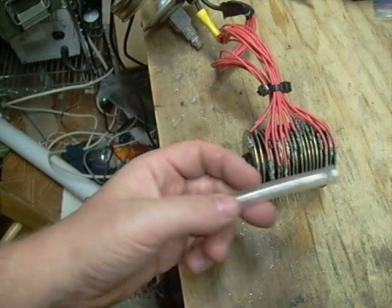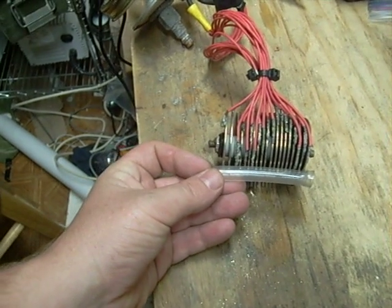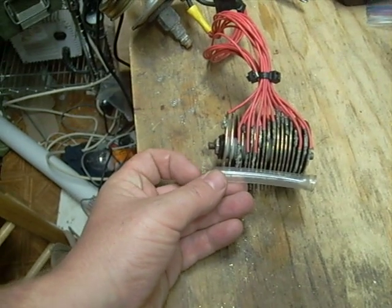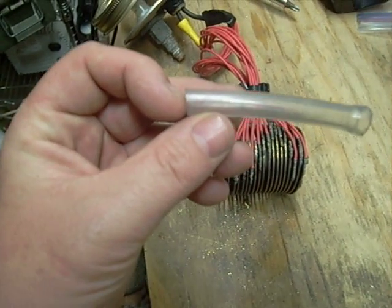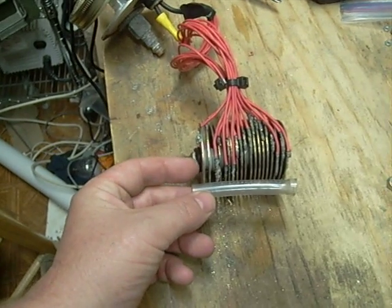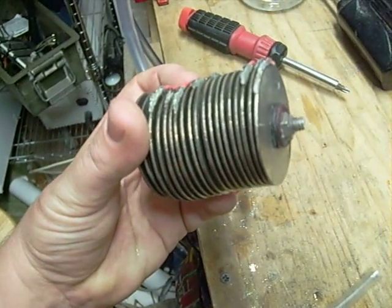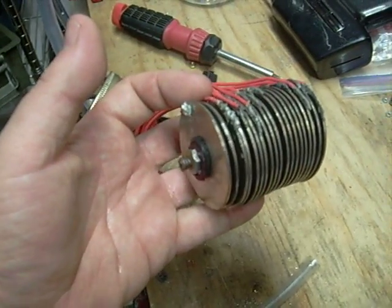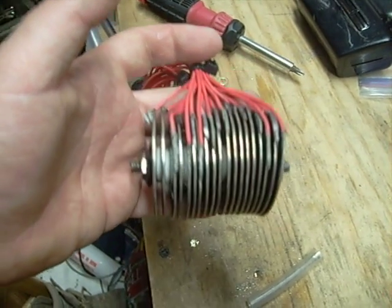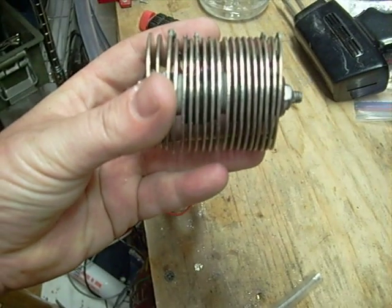First, there is a piece of rubber tubing — fish line tubing from an aquarium — that goes through inside the washers. Then the bolt goes inside the tubing, keeping it from arcing out all the way across, and we fix it with a nut and a rubber gasket or washer on the end. So there you have it: no neutral plates, positive negative positive, 19 plates.